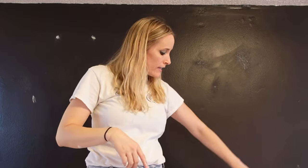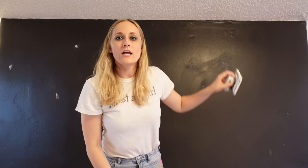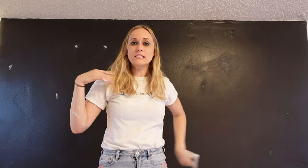Here's how you paint a wall. Think of the frame — ceiling, sides, bottom — and you want to cut those in first, then follow with a roller. This ensures everything is perfectly painted with one continuous wet paint roll. I don't like to cut in with a paintbrush — I prefer my best friend, the paint edger. It's a little pad with wheels that you run along the top of something to perfectly cut a straight line. It holds a lot of paint and lets you cut in easily. If you're painting with a friend, have them cut in while you follow behind with the roller. If you're alone, cut in a certain portion at a time so you can follow it up.